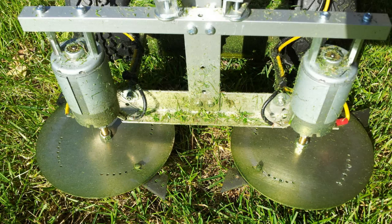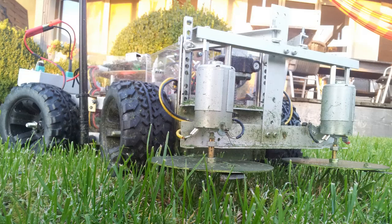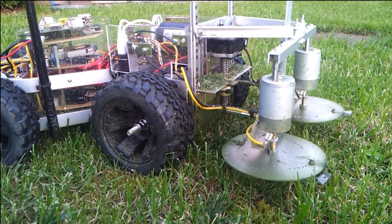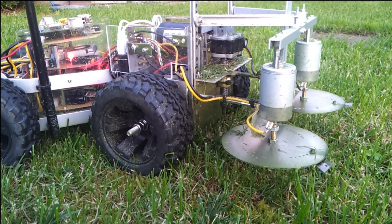The platters themselves offer holes for different blade sizes. Each mowing platter is driven by an 85-watt DC motor. The speed of the motors is measured with back-EMF to regulate their speeds using PWM. The mowing height can be set in software and is applied using a linear motor and a linear potentiometer.